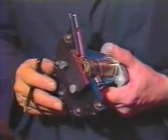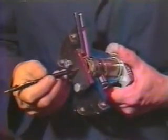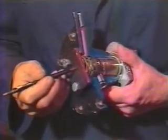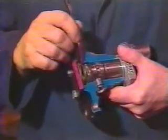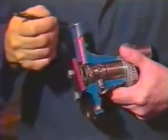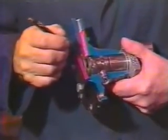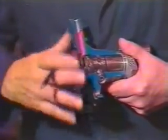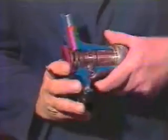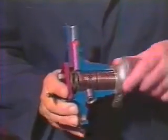This is a cutaway of an 06D oil pump. In the shots that follow, the pump end cover will be replaced with a plexiglass cover. When you look in here, the hole you'll see is the hole in the metal shield. The oil comes into the pump here. You'll see the freon outgassing and vapor being created at the inlet to the pump. As the shaft rotates, these little vanes sweep the oil into the discharge holes. They can't pump gas.